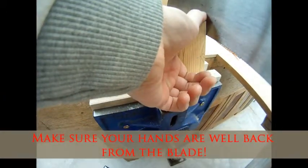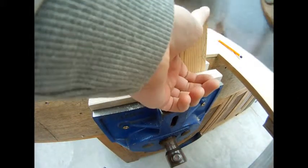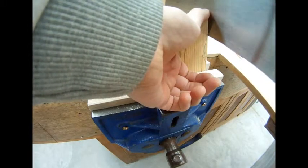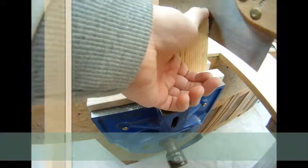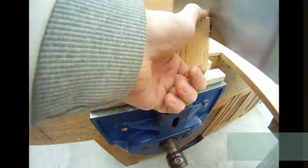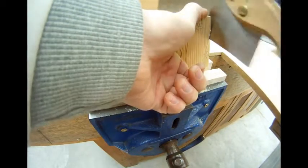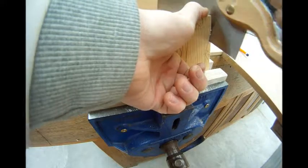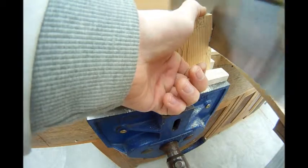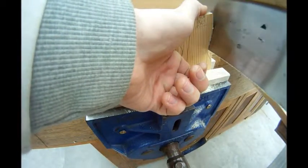This is important. Be very careful here. Starting the saw can often be very difficult. You need to create a little channel and use your thumb to guide the saw. Once you achieve this channel at the start, the saw will lock into it. You can then close in your fingers and move your hand back, and just concentrate on lowering the saw down into the material nice and slowly. Let the saw do the work. Do not rush. Again it is important not to go too deep.